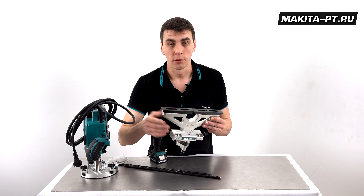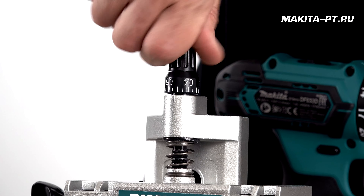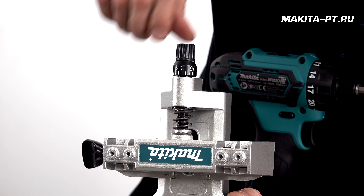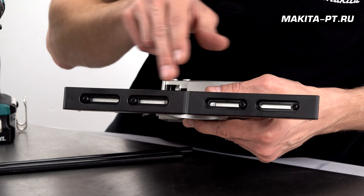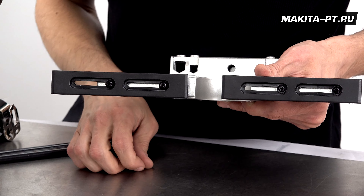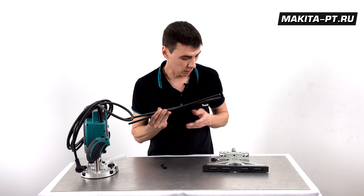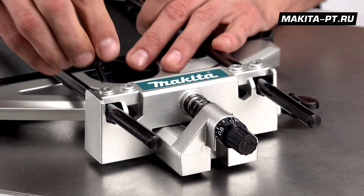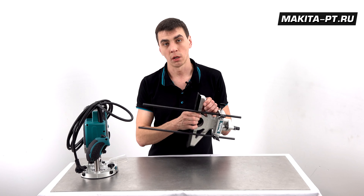The fence from the RP2301 is more substantial, with many reinforcing ribs. It also has a graduated washer — which regulates nothing — and a fine adjustment of 1mm per revolution. After setting, lock with the wing nut. The adjustable contact faces can also be regulated. Separately included are two metal guide rods, each 450mm long, which can be adjusted both in the router base and in the fence itself. They insert into the outer holes and are secured with the included wing nut screws. The entire assembly then installs into the router base by the same principle.